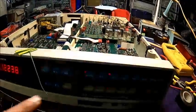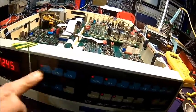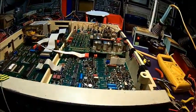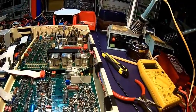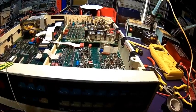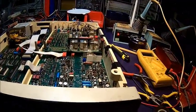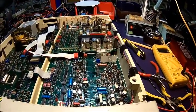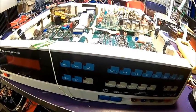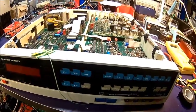I think we can call it good. It works on ohms, works on volts — but as soon as I select an AC range and go back to volts, it locks up. I don't know if that AC option is even fitted. Honestly, I can't be bothered with the AC ranges because it might not be fitted. I barely found the calibration point so I can actually calibrate it. Typical Solartron — almost impossible to find manuals for these machines.